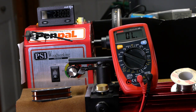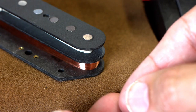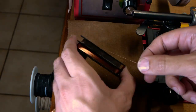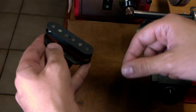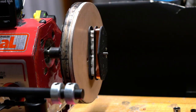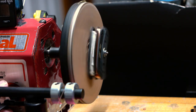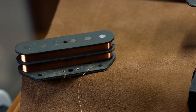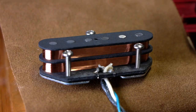Back to the actual building of the noiseless pickup. My personal spin on this idea was simply to use a single, unbroken length of wire. Wind the bottom coil first, then wrap the magnet wire around the top bobbin in the opposite direction, and wind the second coil with the bobbin face down. Then, when it's completed, wrap the magnet wire back through the notch again down to the finish eyelet. Tie it around a few times, solder, and you're done.